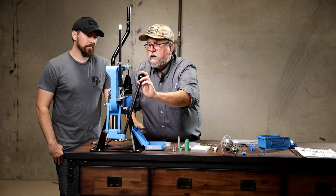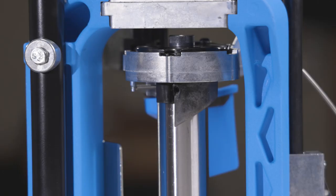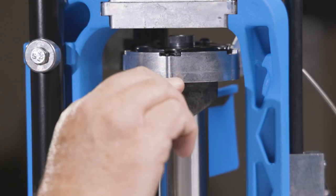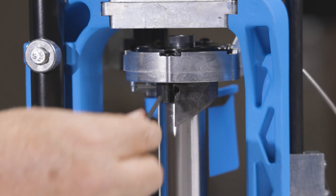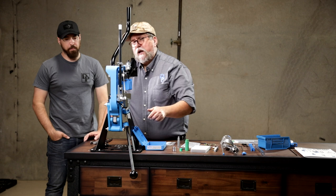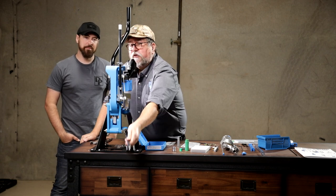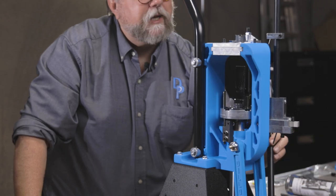Okay, now, if you pull the handle down on the machine, use a 1/8 inch Allen wrench, goes into a set screw, and you just snug that set screw up. You don't need to torque it. It has a brass tip on the end that deforms to match the curvature of the shell plate bolt. Okay, now that we've tightened that set screw, let's lift up on the handle, make sure the shell plate rotates, cycle the handle a few times to make sure everything indexes reliably.